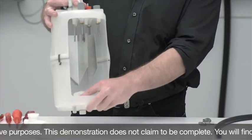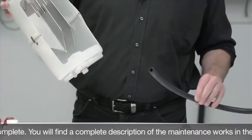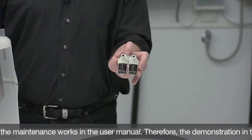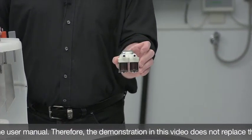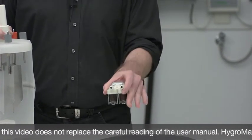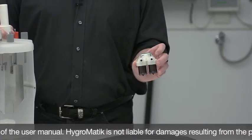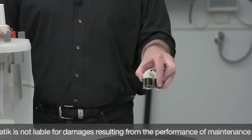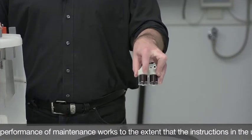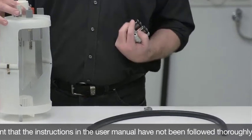I have talked about this small nozzle which is inserted here. To this nozzle leads a hose which is clamped here, and this hose ends at a double solenoid valve. Normally we have single solenoid valves installed in the electrode steam humidifiers, meaning the single solenoid valve needs to be removed and replaced with this double solenoid valve. So we have a solenoid valve for the regular filling of the unit and next the new utility of the super flush, where we then lead the water through this hose to the rinse nozzle which then creates this whirlpool effect.